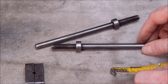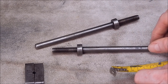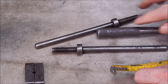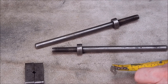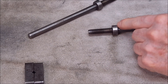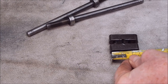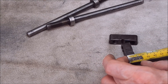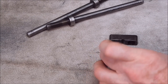Knurling can dig into your fingers — sometimes it's better not to knurl. If it's heavy knurling it can be aggressive, like handling rebar. If it's very fine knurling, like P&N would use — a low-profile, flattened-off type knurl — that won't rough up your fingers. So you've got the measurements on that. The thread looks like Whitworth, but you can make the thread whatever you want. The little blocks are 45mm long, 15mm deep, 15mm across.